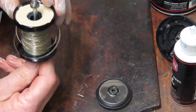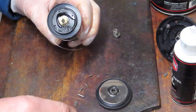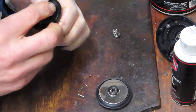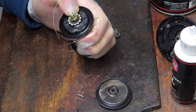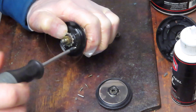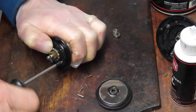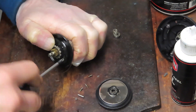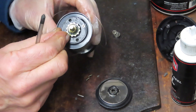The little copper shim goes on the bearing and the whole assembly goes back on. Seat that, then grab the collar. Now take those little screws and put them back in — you might need a micro driver for this. It's always good to set your tools up ahead of time so you're not distracted looking for something you need. It's like what great chefs do — they put everything out ahead of time so they can focus on the task.